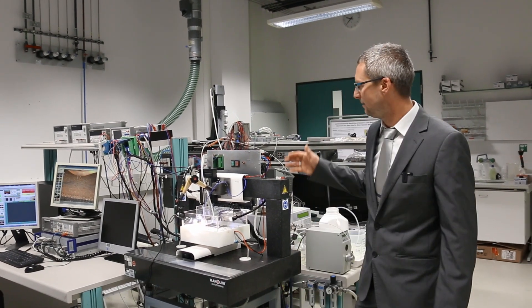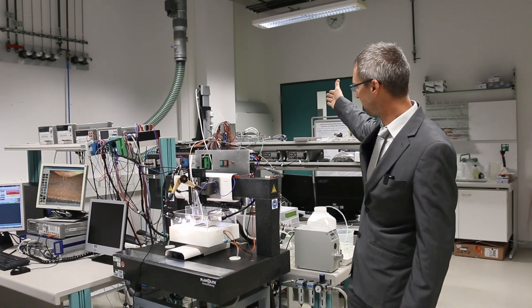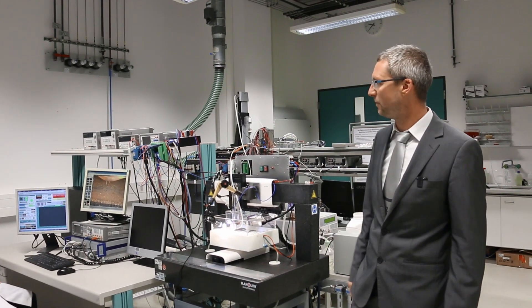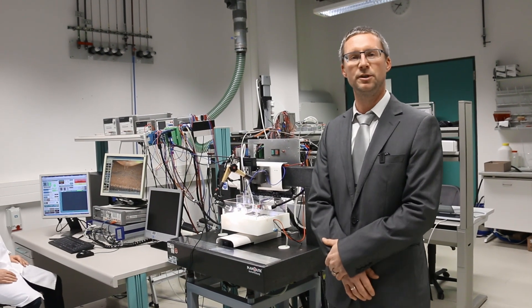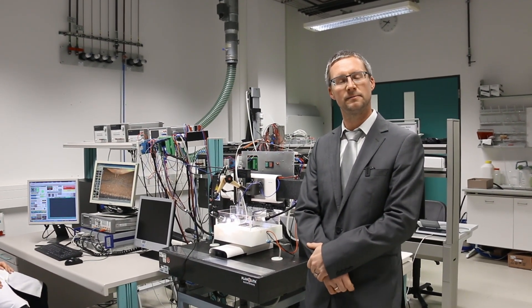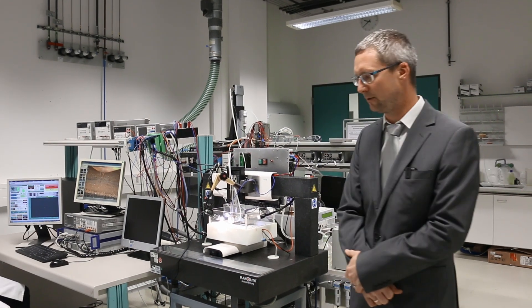Here we are in the lab for the jet-based electrochemical machining technologies. We have on one hand a jet ECM setup, and opposite there is a setup for jet PEP. For jet ECM, we were working on several research projects funded by the DFG, where we analyzed the basic removals of jet ECM and advanced this technology to machining of hard metals and so on. We also worked on an EU-funded project called MicroMan, an MSCA project and innovative training network, where a colleague worked on novel control strategies to control the removal of jet ECM.